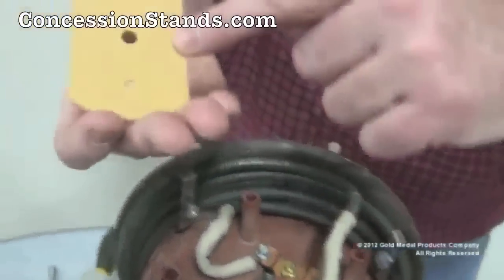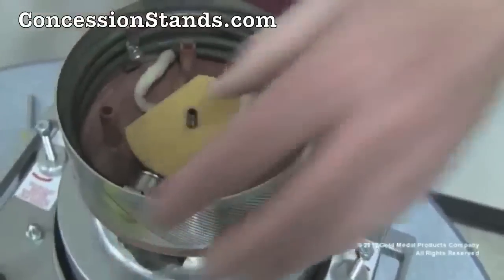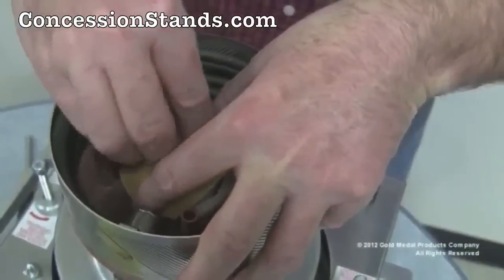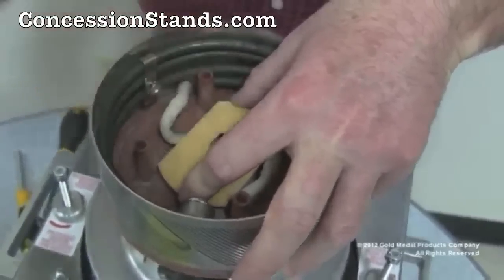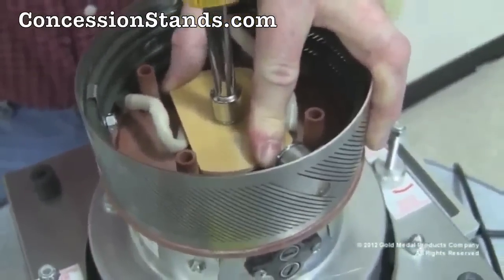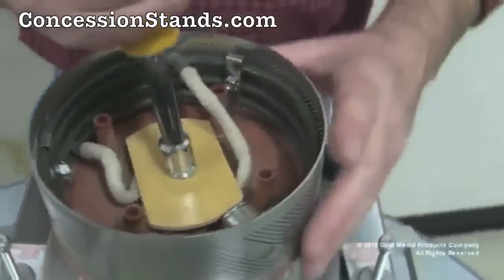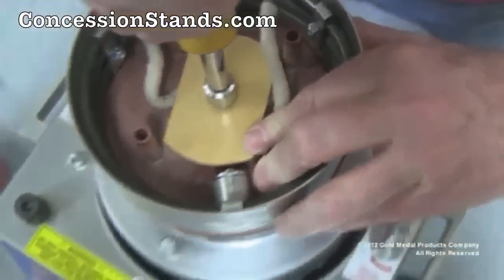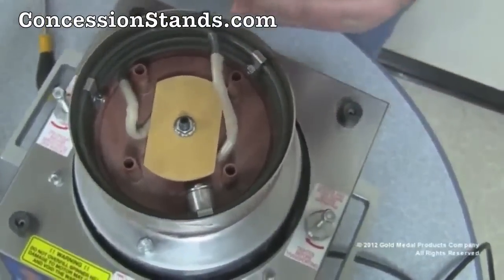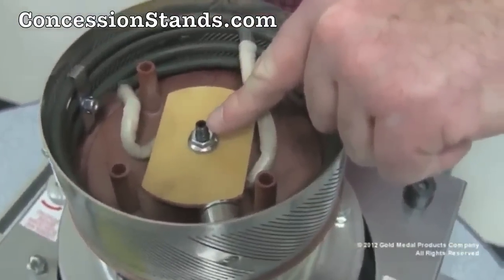Install the plastic terminal guard. There's a top and a bottom side. The bottom side of this terminal guard has 2 recesses. Reinstall the jack screw and the metal serrated flange nut. Position the terminal guard such that the copper terminals are fully covered to prevent accidental contact with those during use. Reinstall the nylon acorn nut on top of the jack screw. This will prevent sugar from building up inside the Allen wrench socket.